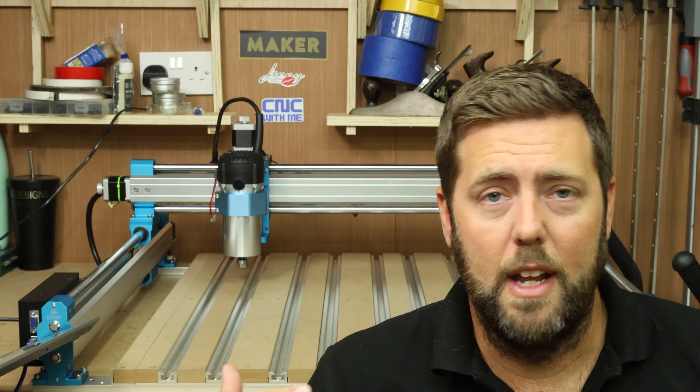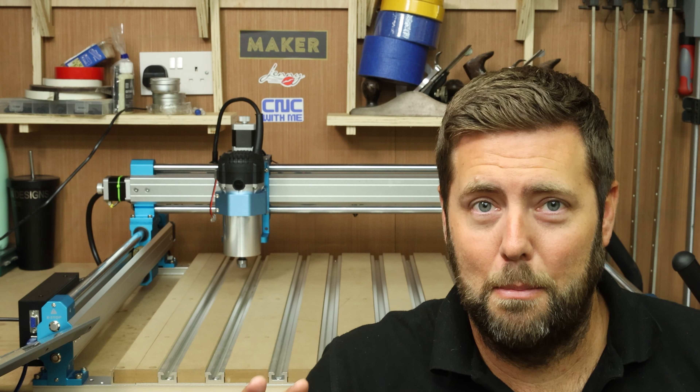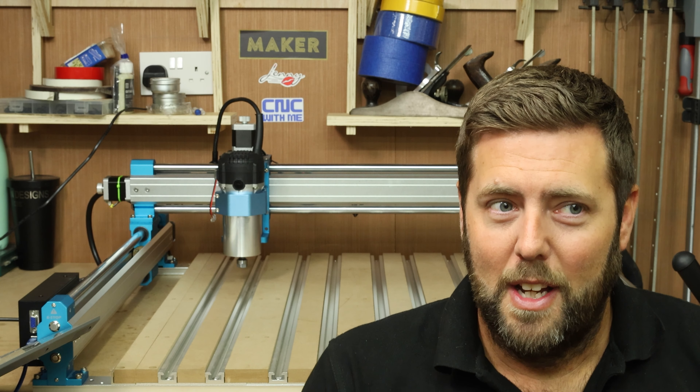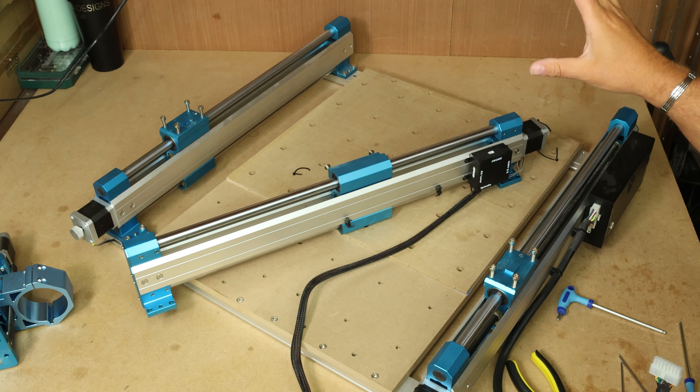Now the machine is done behind me and I'm inserting this retrospectively. Throughout the video you'll see that I struggle with a couple of bolts and the lead screws getting them out of the coupler. The reason is they've used glue or Loctite to build most of the machine, which is probably a little too strong. If you're struggling to get bolts out and about to round them off, ease off, apply heat with a soldering iron or small blowtorch — the heat releases the glue and makes disassembly easier.